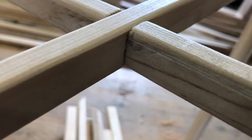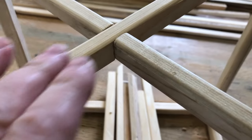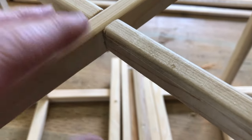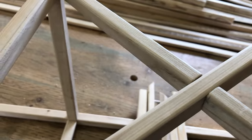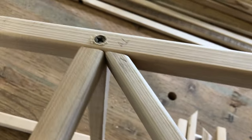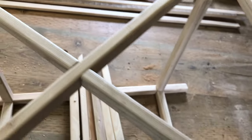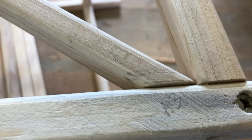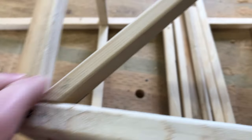And there's our lap jointed piece in place. Turns out it's not exactly a straight cut. It's offset by 2 degrees, 2.5 degrees. So yeah, a little bit of fiddliness, but ultimately we get a nice fit up here, nice fit down here, nice fit here, and a nice fit here. So I'm quite happy with that.